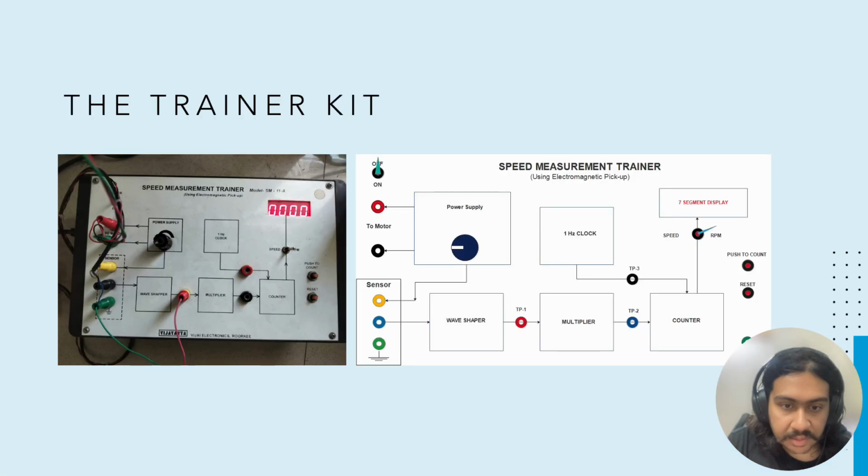Okay, so now let us briefly go through this trainer kit. There is a power supply for the motor, and the sensor input is connected through the wave shaper, and a multiplier which basically do some signal manipulation, as well as a counter to register the number of pulses per second, and which is operated with a 1 Hz clock, and a 7 segment display. So we will go through them in more detail when we are doing the theory.